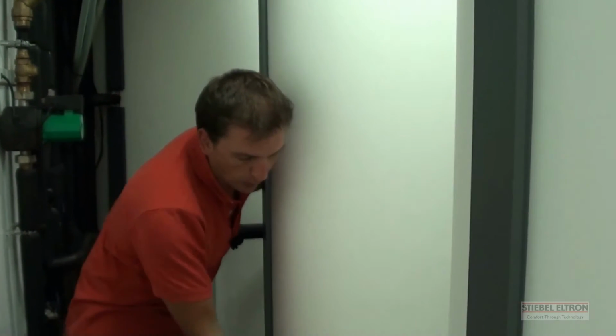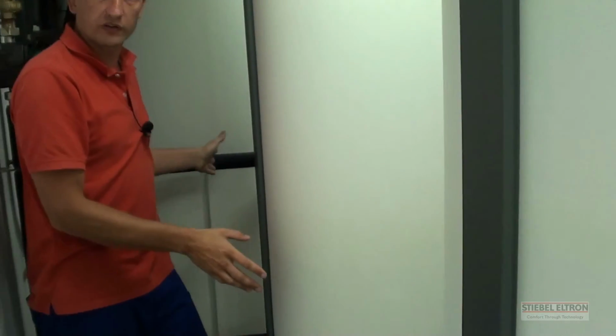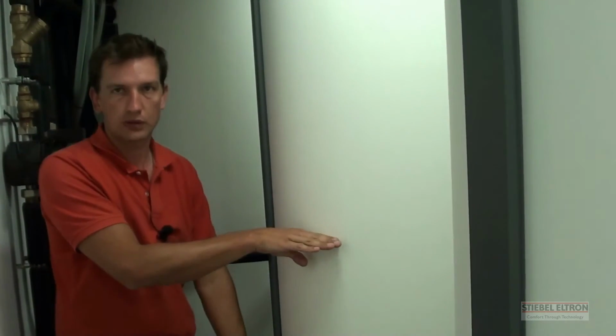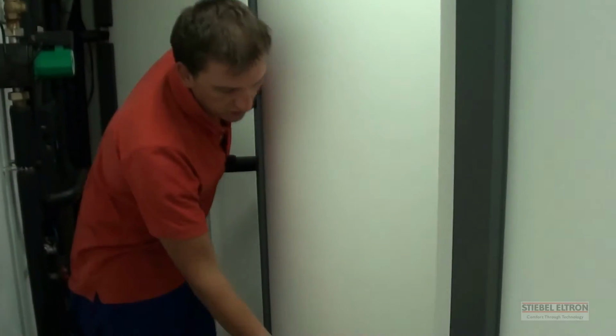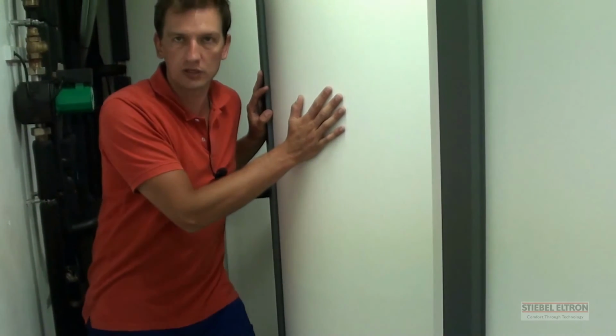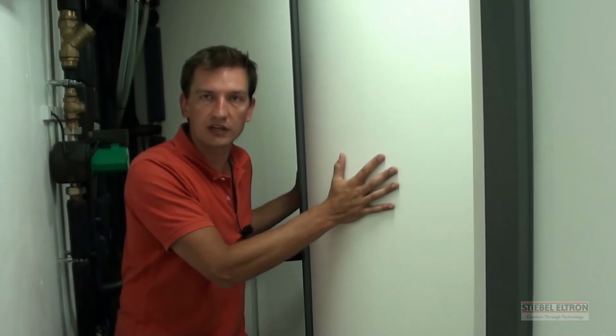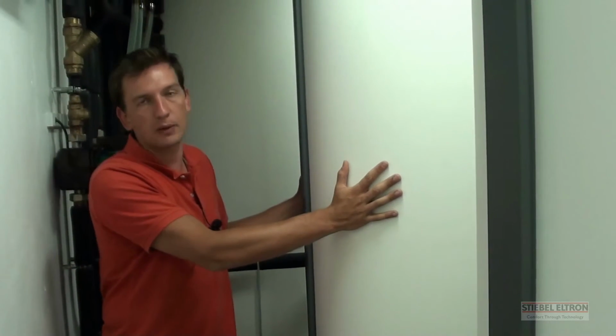Now, the solar energy is actually pumped into the bottom, same as the hot water system, and heat is contributed into this tank on the same layering principle. We've got two heat exchangers again, one for the heat pump and one for the solar. Now, if there's enough solar, it will heat up the tank. If there isn't enough solar, the heat pump will kick in.